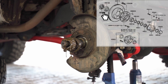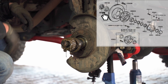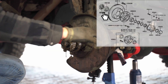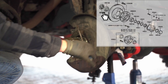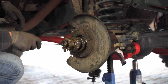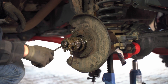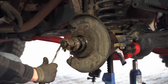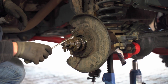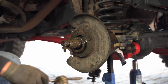This is important because if you use a seal puller you usually destroy the seal, and if you don't remove the seal you can't get out the rear bearing. Remove the 54 millimeter locking nut again — try not to touch anything. It's really amazing how much water got inside, but that's the result of being lazy: 30 minutes underwater and it's full of mud and whatnot. The seal here is pretty much intact.